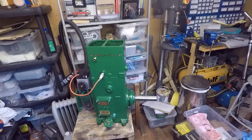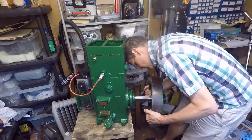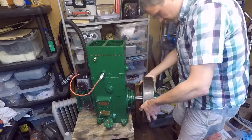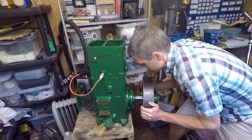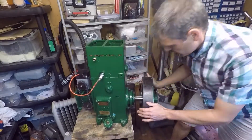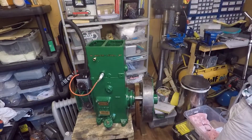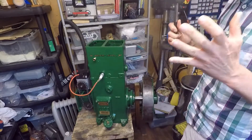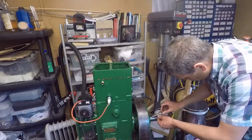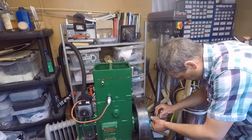Now it's the moment of truth. I've got the flywheel much hotter than this, and the theory is that it's going to slide straight in. I need to give it a bit of persuasion with a rubber mallet. That took a little persuasion, but I think we're in a good place now. This is all being lubricated - there you go, nice little fitting with the key.